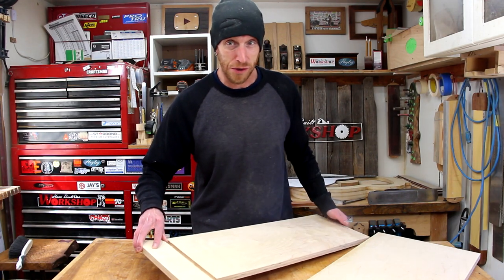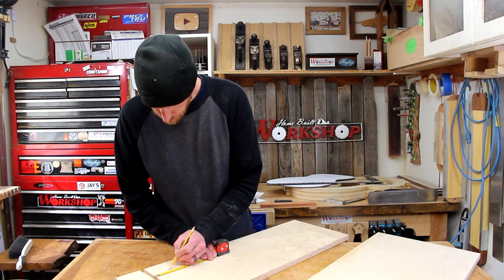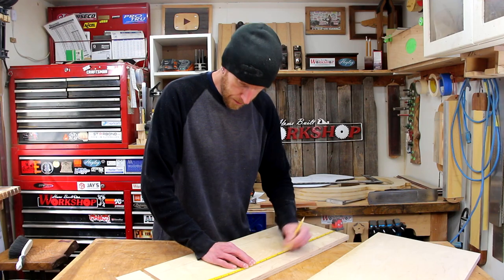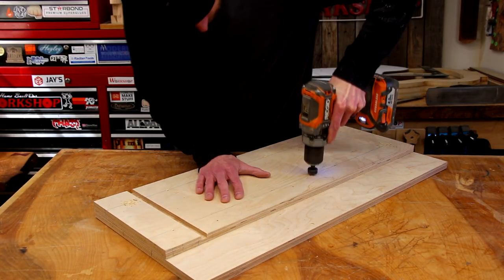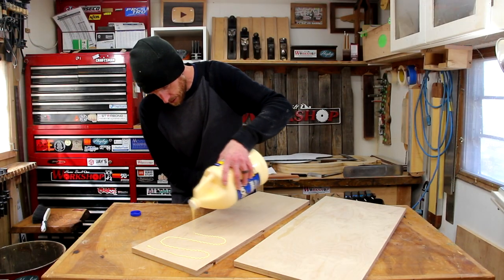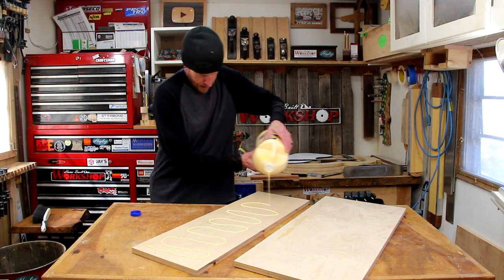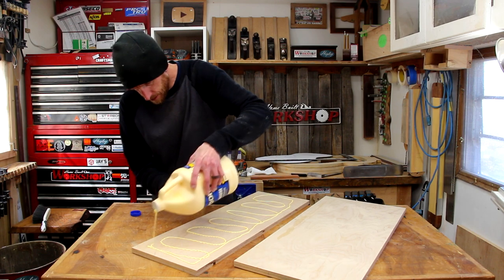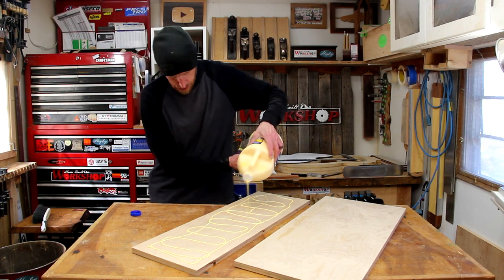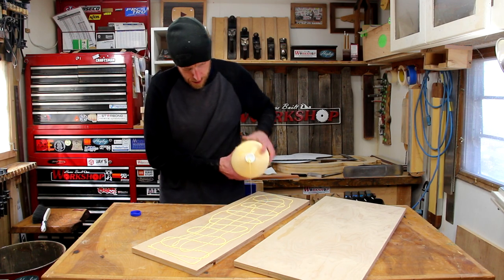Really, this couldn't be much simpler. First, I'll lay out the locations where I'm going to drill some pilot holes for screws. While applying the glue, I'm going to be very careful not to get too much near the edge where the hand plane's going to ride. I want to try to avoid as much squeeze-out there as possible — having any glue in that area could affect the angle that the hand plane touches the wood.